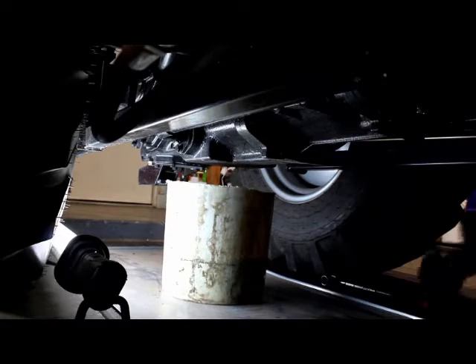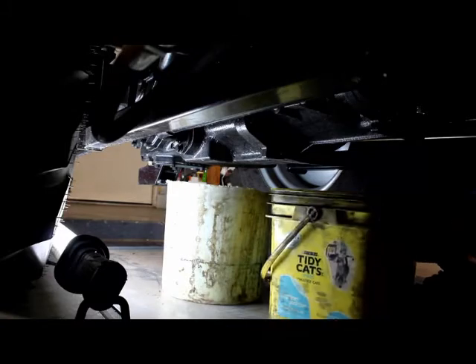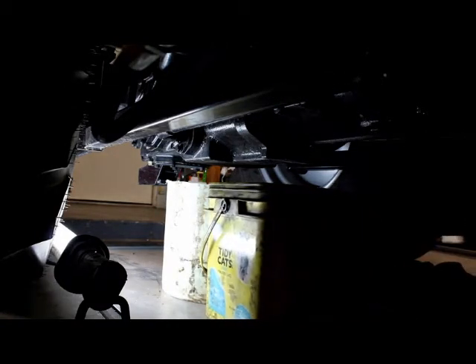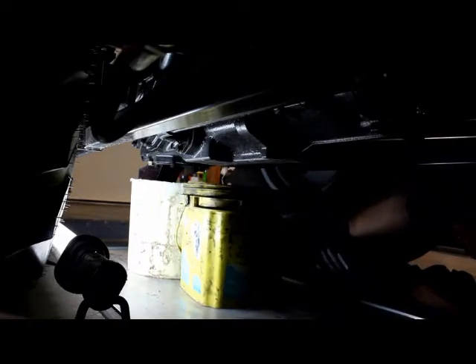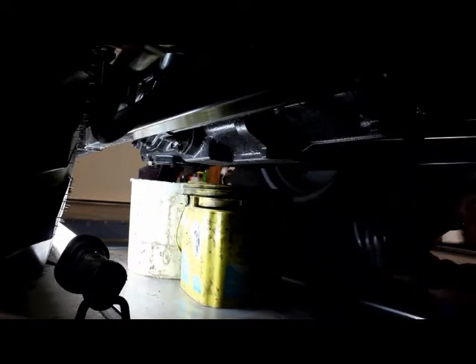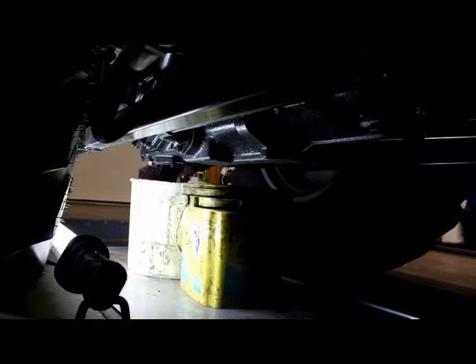After about five or ten minutes, it looks like we've drained most of the fluid out of this thing. I'm going to remove that last bucket and slide a fresh one underneath to catch residual. I'll let it continue draining while I do other things. In the meantime, I'm going to dump that last bucket into a canister. The plug is cleaned and ready for install, but I'm not going to do it just yet. I'll pull our two filters, inspect them, replace them, and then move on to the next step.